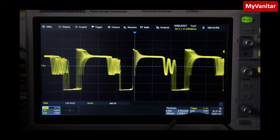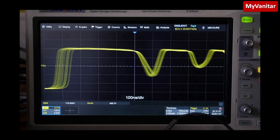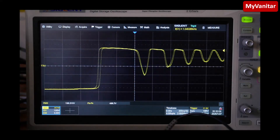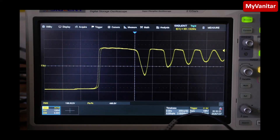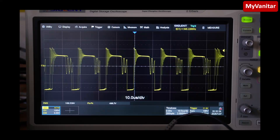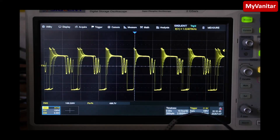The second thing to check is the shape of the ringing — we should not see sharp edges. Playing with the time knob, there are no sharp or hard edges in the ringing. For me, the snubber does the job and it's good. However, my suggestion is to increase the capacitance — currently 12 nanofarad, you can increase to 22 nanofarad and check these edges again. But for me, this is a pass for the snubber. That's it for this project — I hope you like it. We'll do something else in the next video.